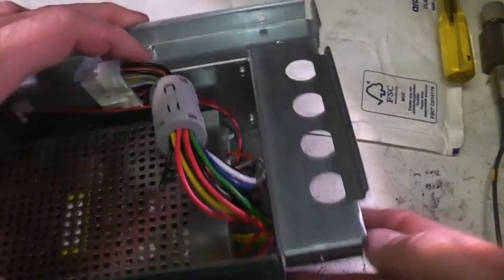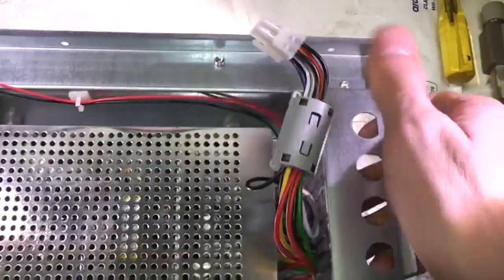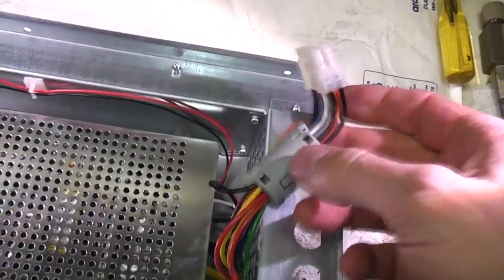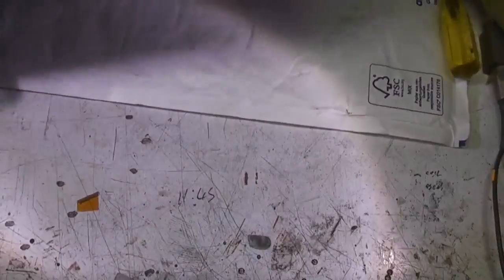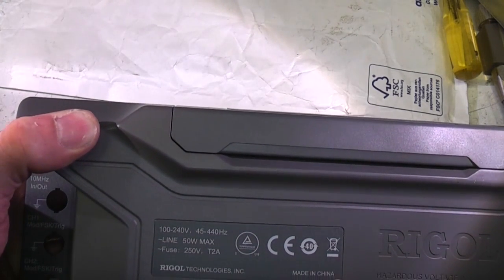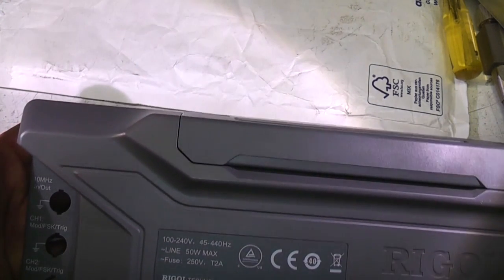This casing is probably the strongest, toughest thing I've seen in any bit of test equipment built in the last 10 or 15 years. It's all riveted together, about 1mm thick steel, riveted into square sections. If you drop this thing the casing might disintegrate, but the thing's going to carry on working — it's just so well protected and obviously very well shielded. They've got an EMI filter on the power, so they're obviously serious about getting genuine EMC results rather than the usual Chinese fakery. It's got TUV and CE marks, but there's no FCC mark — maybe they just haven't gone through that process yet, but I've no doubt they'd have no problem getting all certifications based on the build quality.